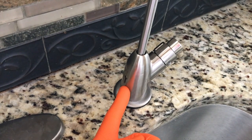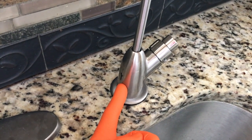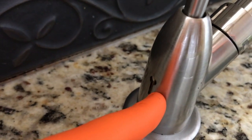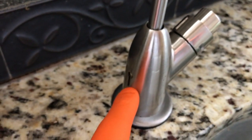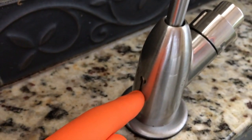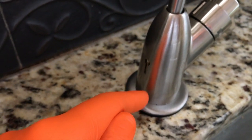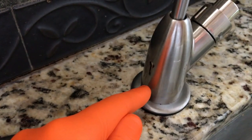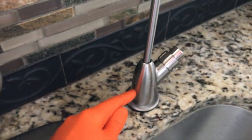Not all areas or states require it, and because of that there are online plumbing vendors that manufacture a bypass kit — that's what we want to talk about. Take a listen to that air gap. What's happening is the drain water comes out of the membrane, makes its way up into the base of the faucet, loops over into a small cup, and the faucet brings in air. That drain water then enters a different tube, drains into your lower plumbing, completely removing itself from your RO system to prevent backflow of dirty water.